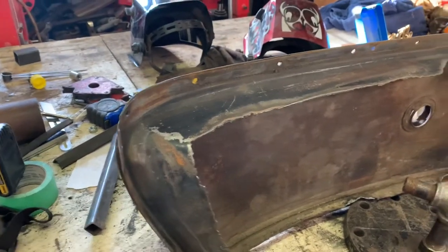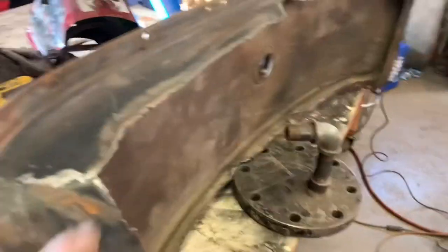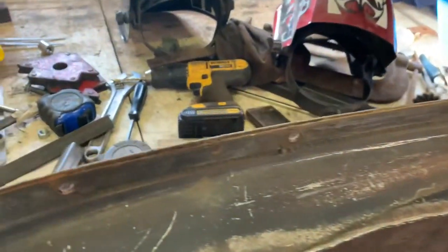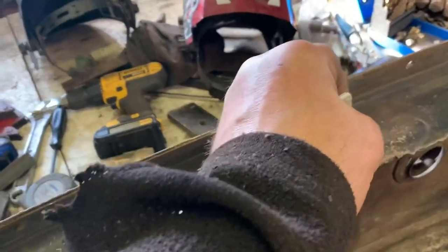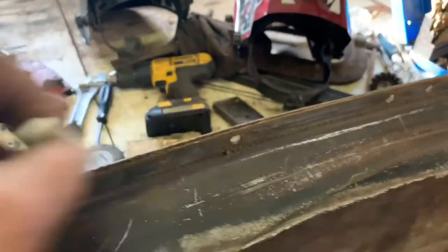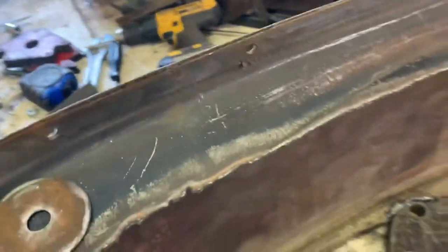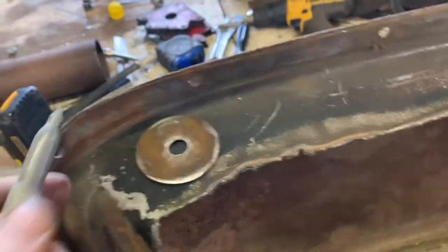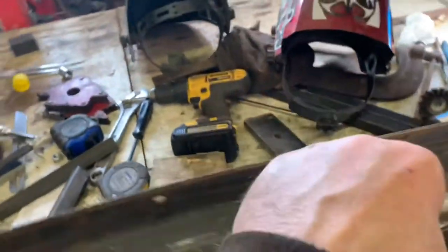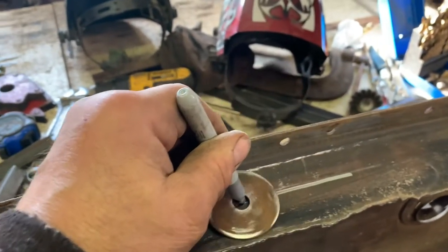Okay, this morning I want to take this former Model A gas tank that we had the big smoke show with yesterday, and just clean it up a little bit. A lot of times we have to make a nice parallel line. You can use your finger like that to make a space, but I got a little help tip for you guys today. If you use a washer, I'll start down here maybe. So I want to make a nice even cut line. Look at that, eh?